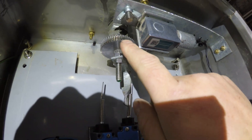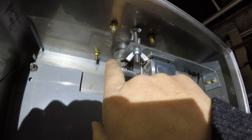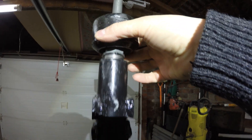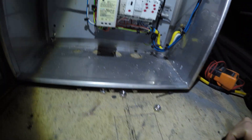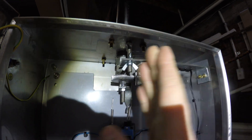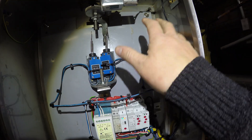We've got the worm drive and gear here, double nuts to keep it locked tight. We've got thrust bearings in the bottom and a waterproof jacket for the top — I don't want water coming in and leaking through the shaft. Thrust bearings up there too; they allow it to rotate nicely, designed to take weight in the vertical direction with little ball bearings. The motor is adjustable with wing nuts so you can tweak it up and down, or left and right. It's 24 volt — these are all 24 volt cables.